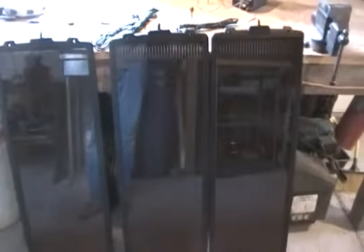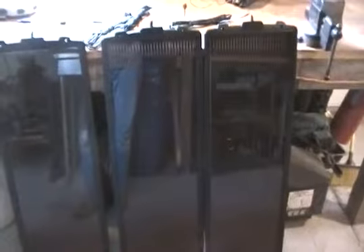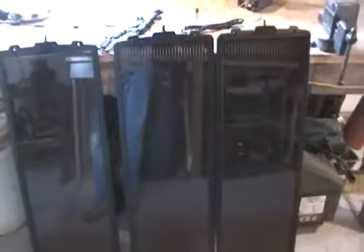Basically you're going to get three of these panels. These are 15 watt panels, so combined they total 45 watts. I have a Sharp 235 watt panel outside and it's about the size of all three of these. So for the same space, you get 45 watts compared to 235 watts — the Sharp was a lot more money, but solar panels are definitely coming down. This is what I'm recommending if you are starting out and not mechanically inclined or familiar with electronics. This is the perfect set for you — it's what pushed me into solar and I now have four sets.